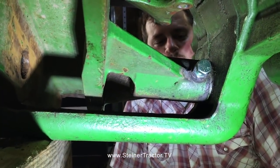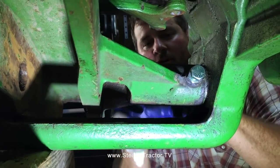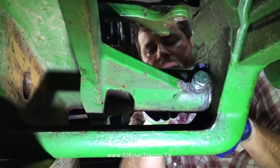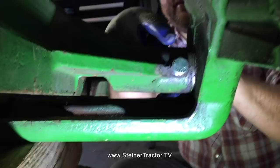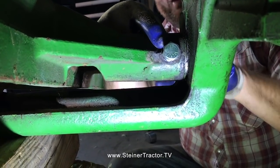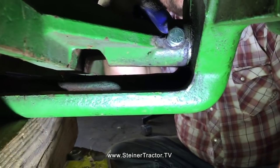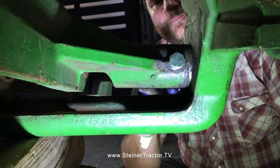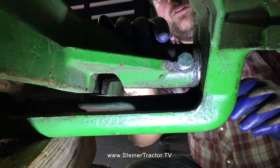So we've got our rear pivot pin installed. Essentially, to install the axle housing, you had to slide the pin all the way forward, flush with the end here, into the housing, and get everything lined up. There's actually a dimple in the pin. We've sharpened the end of a bolt in this case because we didn't have the correct bolt. The original Allen head set screw and tapered pin broke off when we tried to remove it initially. So we put this in. We already had the front in place, as you saw earlier.